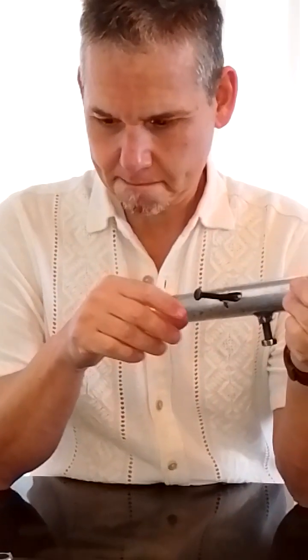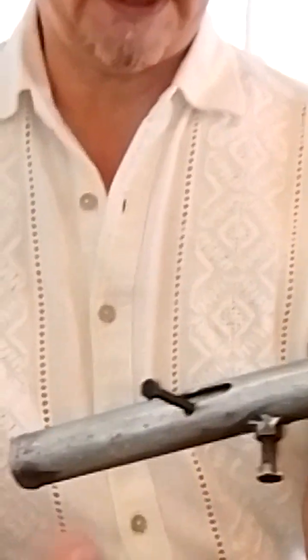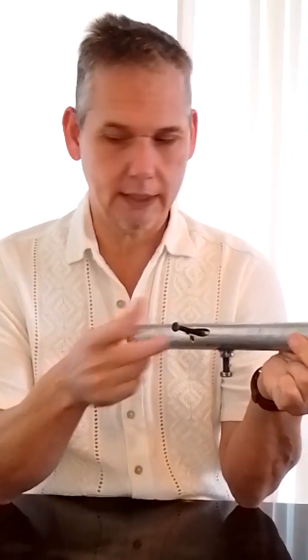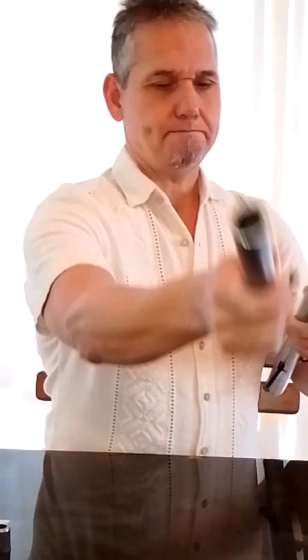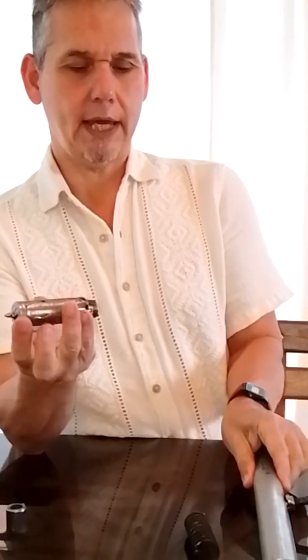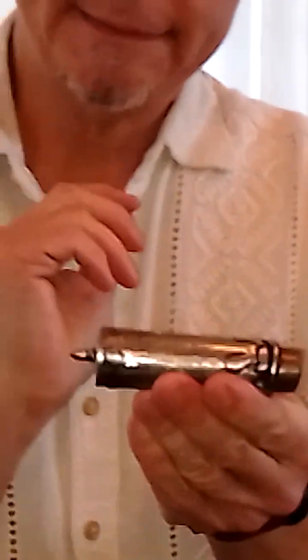I was working on this and it didn't work. Before I continued working, I tested the striker — not with a live shell, but with primers on empty shells — and this spring and striker mechanism didn't work, didn't ignite the striker on the shell, so I stopped working on it. I think the piece is too heavy and doesn't get enough velocity to hit the primer.